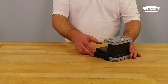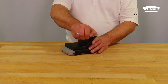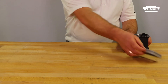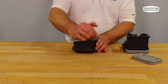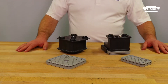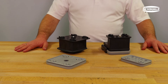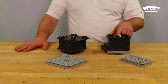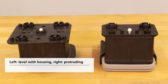To replace the touch valve, the suction plate should be removed first. The corners of the vacuum block offer the least resistance. After the suction plate has been removed, you can see whether the aluminum capsule of the touch valve sticks out from the vacuum block housing or is level with it. This is relevant for removing the touch valve.